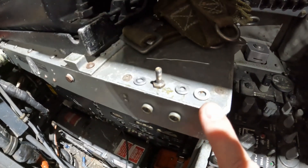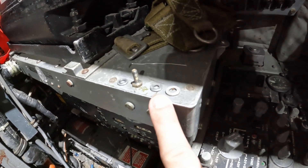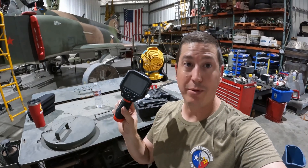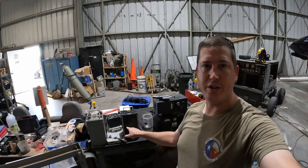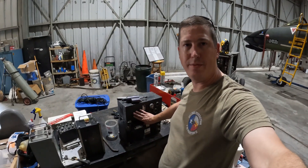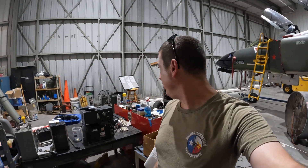That's what I fished out from underneath here. I haven't found anything else so I'll do one final sweep of the bore scope camera before I run the seat back in here, clean it up, and start remounting everything. Bore scope camera sure came in super handy today. We'll do another sweep for FOD in the electronics and equipment compartment underneath door 19 before we start putting stuff back. Here's some of the assembly for the back seat. I'm going to run the seat back, put the transformer rectifiers in place, and then start putting equipment on the equipment shelf — that stuff had to come out for the AC power box to go in.